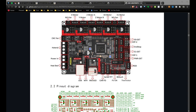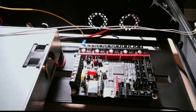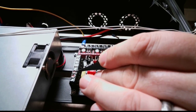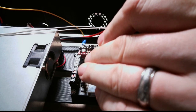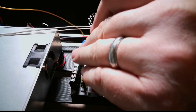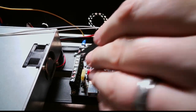I'm going to start with the power in and heated bed. Looking at the board, I've gone ahead and color-coded things — the red wire for power in goes right here, and the red for the heated bed goes right here, so the reds are right next to each other. The power in is this middle set, and the hot ends are right here.